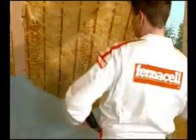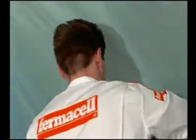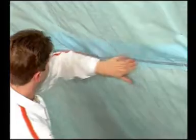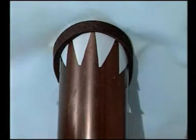To ensure that the construction complies with building regulations, it's recommended that a 0.2 mm polythene film is installed as a vapor control layer and to ensure air tightness. The sheets are overlapped approximately 250 mm and taped at joints and edges. Large holes or penetrations should be carefully sealed to ensure the continuity of the membrane. Care should also be taken at junctions between walls and adjoining structures.